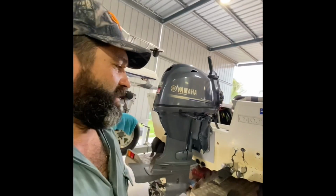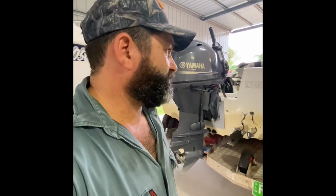The trailer is not in the back of my mind. I can go on the Gibb River Road, go on the road through the Gulf of Australia. Trailers just snap continuously. It starts with the U-bolts. The U-bolts stress, they bend, flex, snap. That's the first failure point on any trailer, U-bolts. Sorry to a few people building, but it'll come. Unless you build a U-bolt that's off a rear diff of a Land Cruiser ute or a Hilux, high tensile, proper one, anything that's galvanised will fail.